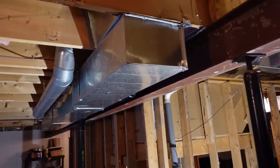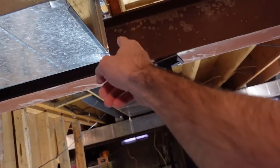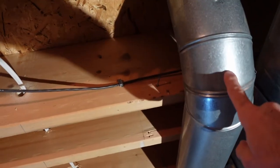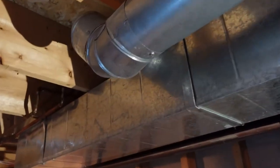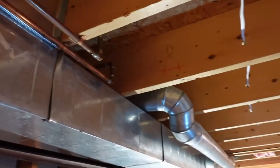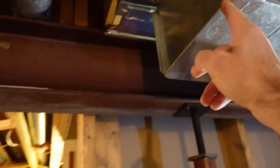In this video I'm going to be framing out around this ductwork. The larger duct is the cold air return and the smaller duct is for the hot air. I'm not going to be framing out much of the steel beam today — I'll do that at a later time. However, where it is near the duct, I will capture the steel beam within the confines of this framing. The remainder of the steel beam will be framed with oriented strand board and two-by-twos on a completely separate day.